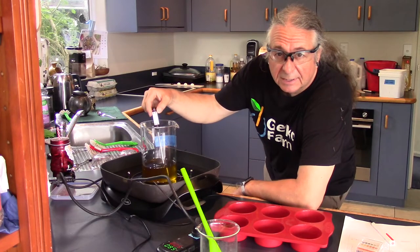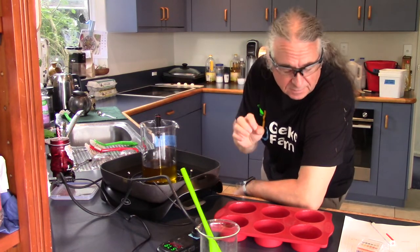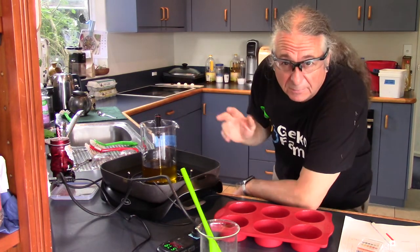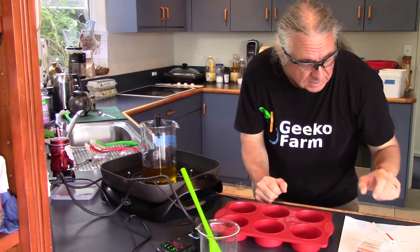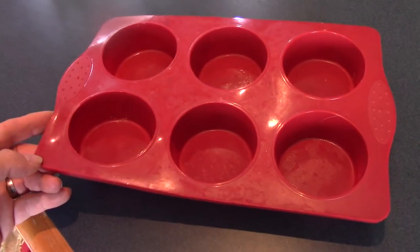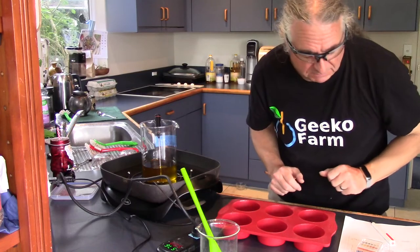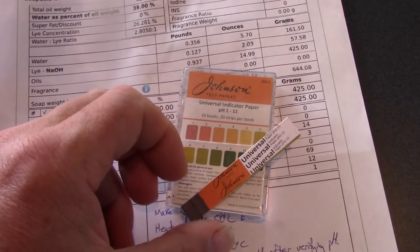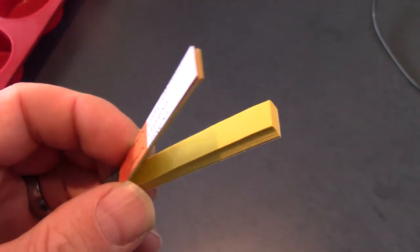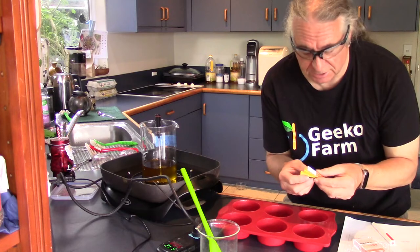The temperature is now actually 52 degrees Celsius — 5 degrees either way from 50, that's fine. It will get hotter when we add in the sodium hydroxide solution because there will be a reaction. I also have one of these silicone trays that ladies make muffins in, and some universal indicator paper, which is available from brewery suppliers, garden suppliers, and pool and spa shops.